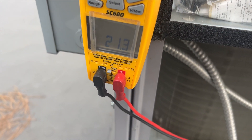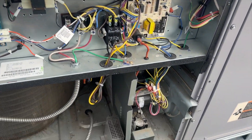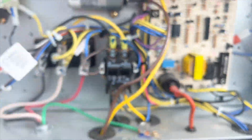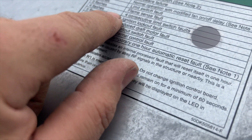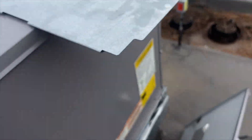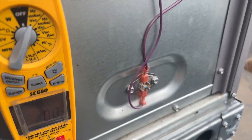We have a W2 call and a W1 call. Let's see if we have any error codes going on — one, two, three, four — we got four flashes. Let's find our error codes: four flash is a limit switch fault.